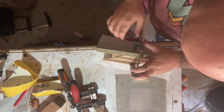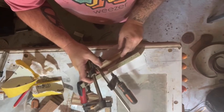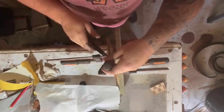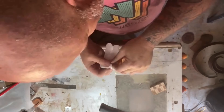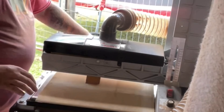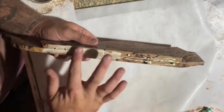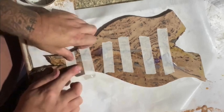After that I ended up cutting each blank into what I called tiles — at fingerboard thickness plus two veneers, cut to a certain length. I cut a scarf on one of the big blocks and then just followed the scarf with each glue-up. This here is the headstock plate, which I ended up getting two out of.